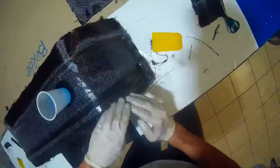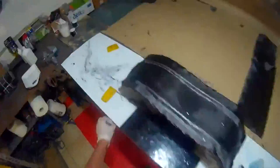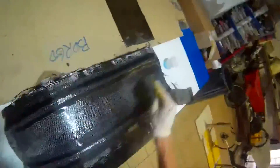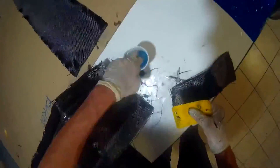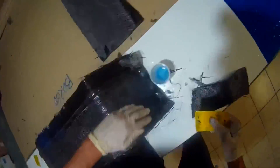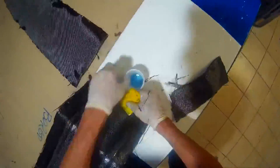Another layer — this is actually the fifth layer — and this part is very important because you must use your fingers to take all the bubbles away. If some air bubbles are inside the layers of carbon, this will result in a seat that is not hard enough and can break very easily if you don't do this part of the work properly.